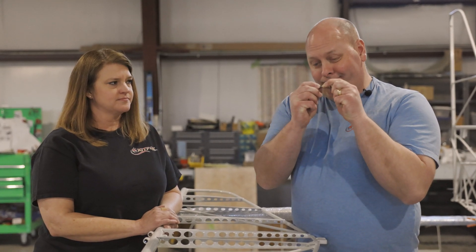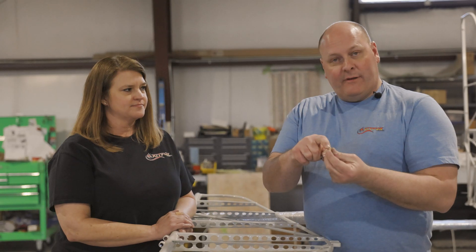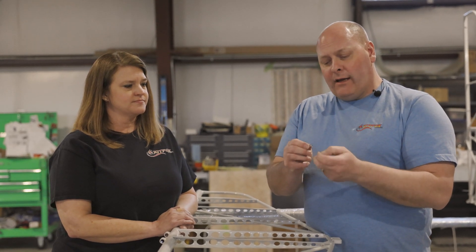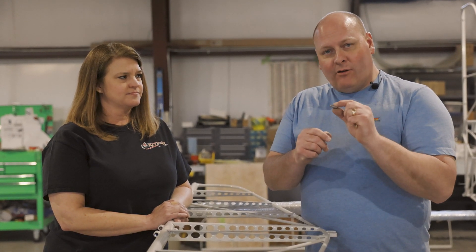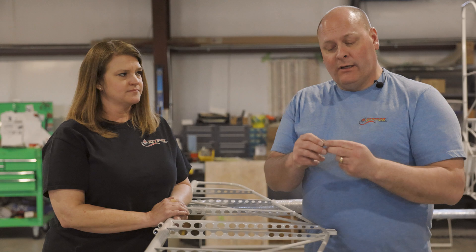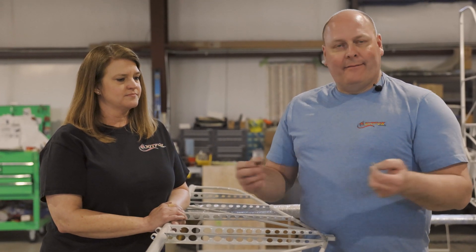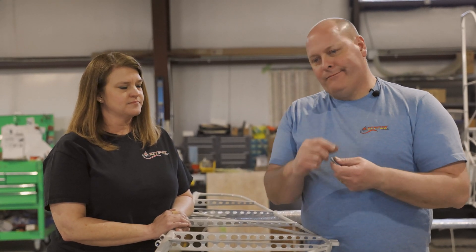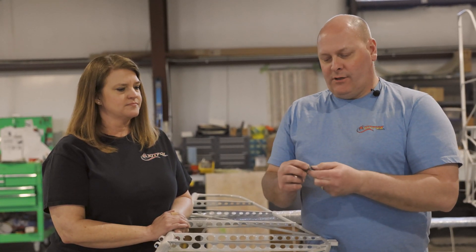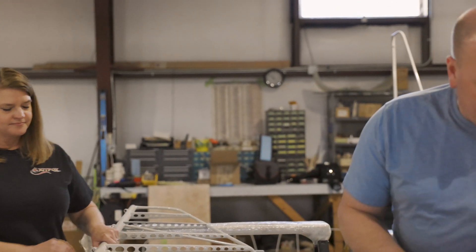In this particular case on our airplane, the steel bushing doesn't go into the bronze bushing. So I'll ream this, and if it still doesn't fit quite right, I'll start working on the outside edge of the steel bushing to get the fitment I want inside the bronze bushing. There's not much I can do past reaming the bronze bushing. If you had a lathe you could work it that way, but most people don't. So in this case, I'm going to work the outside of the steel bushing.